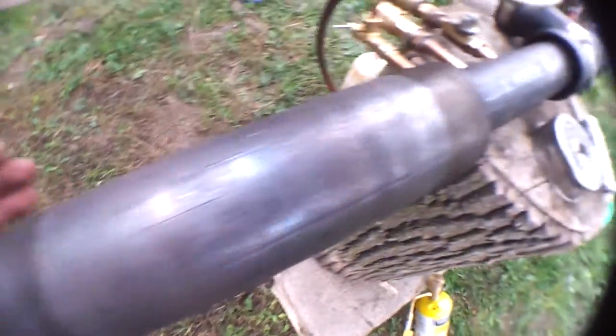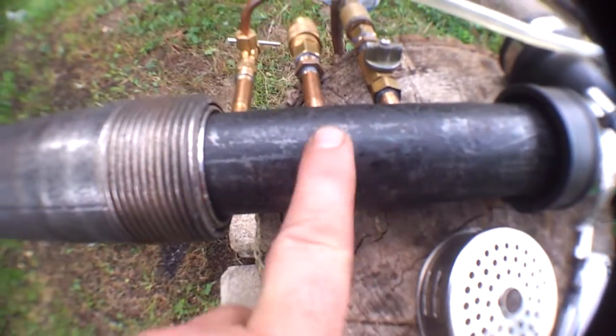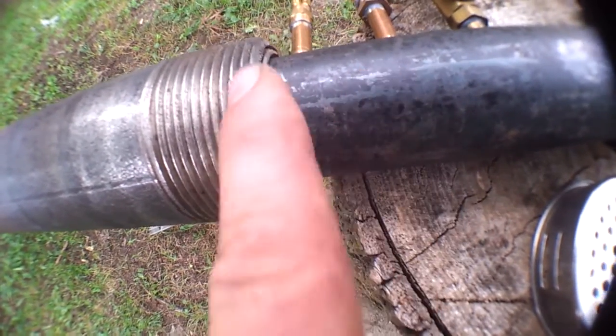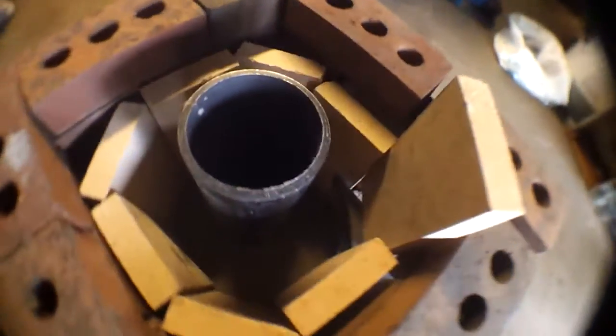The main body is an inch and a half piece of pipe. I may redo this and make it a two-inch pipe. I have a two-inch piece here to make up the difference between the inch and a half and the three-inch. This three-inch piece is going to be the same size as the pipe going into the furnace. You can see here — this three-inch pipe comes in, not cut at quite the right angle since it was scrap I had laying around, but you can see how that's going to work out. The fire is going to come right out here and swirl around through the chamber.